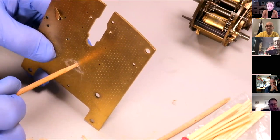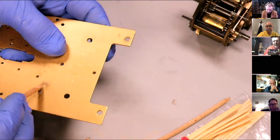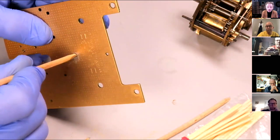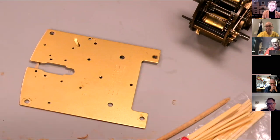I always do this when I'm deburring new holes that have been bushed. If you ever do any bushing, it's really cool on the inside. But more importantly, without touching the plate, of course, and this is a tricky bit, you've got to get your pegwood the right size, to refinish the oil sink without touching the plate. That goes against a lot of the stuff that I've said, but it's a cost-benefit exercise. I would rather have the oil sink a bit refinished and a bit shinier than have the remnants of oil in there. And maybe the oil sink isn't a bearing surface, so I'm sounding completely hypocritical, but that is one of those things that makes me think I've done a good job, not that there's any such thing as a good job or a bad job.